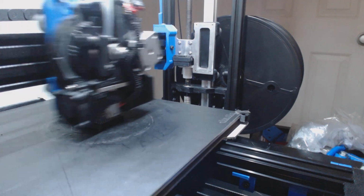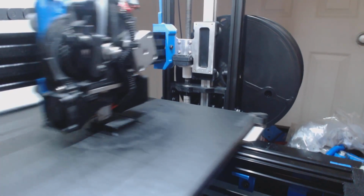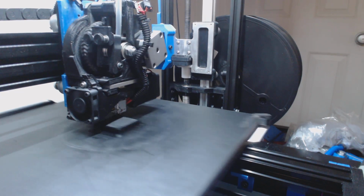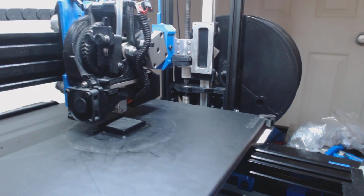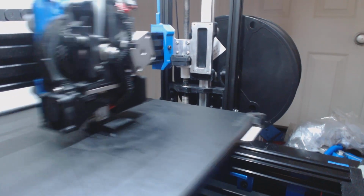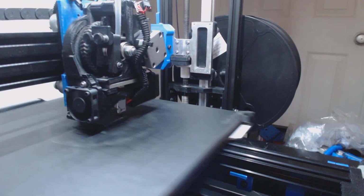For the next speed trial I do, I would not keep the spool on the frame. That's actually part of what I think my bobble back here is, just the wobbling from that spool. I definitely think that back bobble I'm getting on the top there a little bit is just the extruder. I'm not sure it can keep up with this the way it is right now.